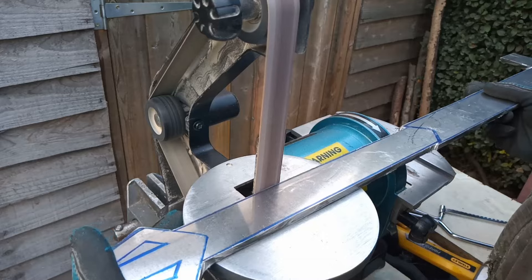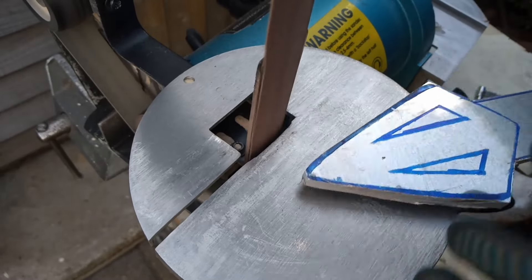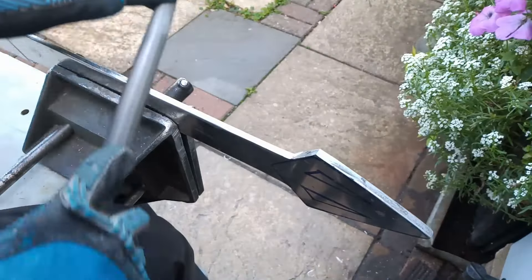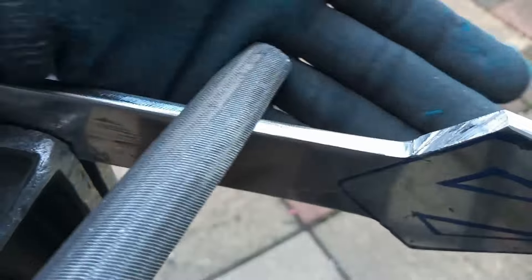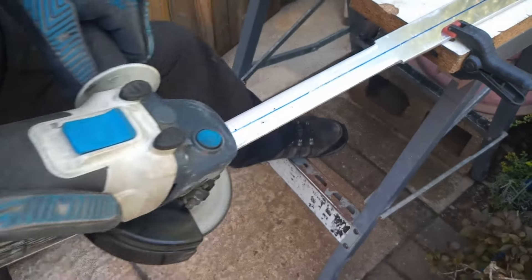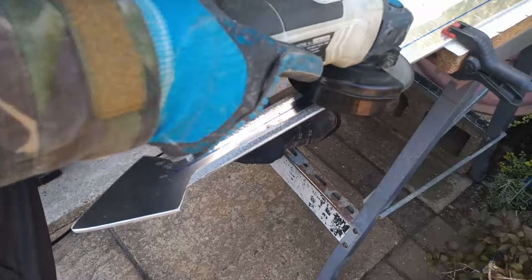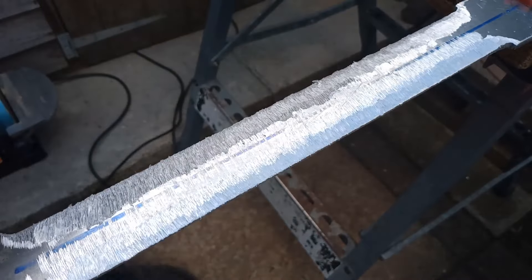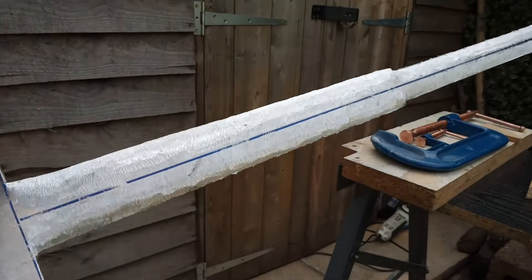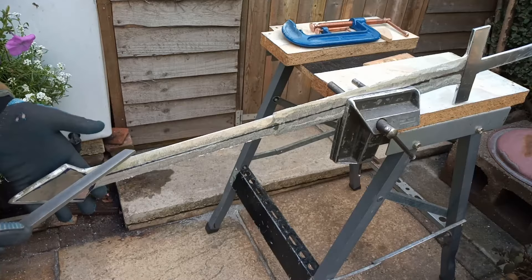As you can see I'm doing some more detailed work, shaping up the actual blade a little bit more, getting all of the edges refined, and now I'm moving over to using a file — just hand filing to get even closer and get a little bit more detail work done. Something that takes a little bit of time but is actually very therapeutic. Next we're going to be grinding away a lot to shape the blade itself. It does take a lot of time to grind it out and refine the edges, but you just have to have patience and stick with it because in the end I think this is going to come out pretty nice.